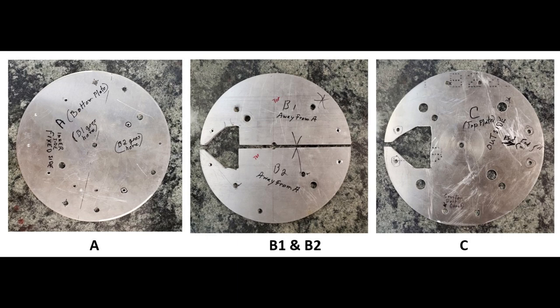Basically, B1 and B2 are mounted on plate A. Not shown, but there are two spools, two studs, mounted in the gap to plate A, such that once assembled, you can wrap one end of the tape into that space around one of those spools to hold the tape. It comes out the gap to the left, all the way around, and back into the same gap to a second spool. They are held by screws into plate A, so you can wrap the tape around the spools, put it around the mandrels, back in, and secure the other end to the other spool. By spinning the spool a little bit, you can tighten up the tape so it holds firmly, very evenly spaced all the way around the mandrel, which is key for a good band.